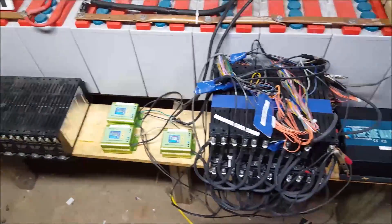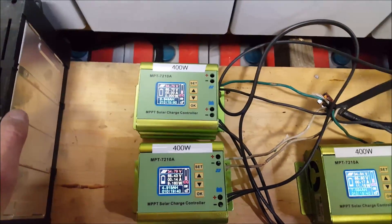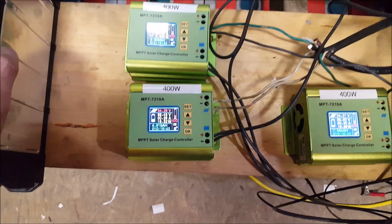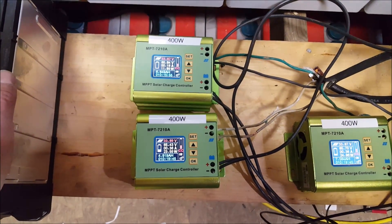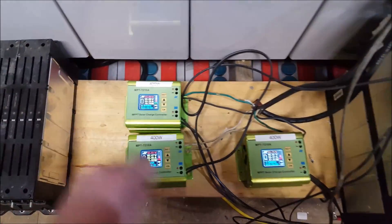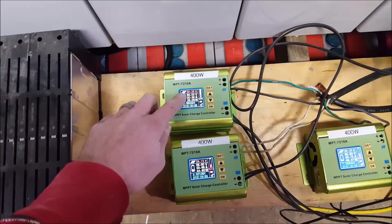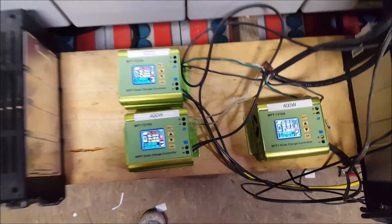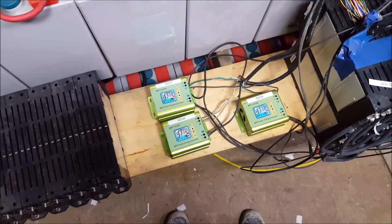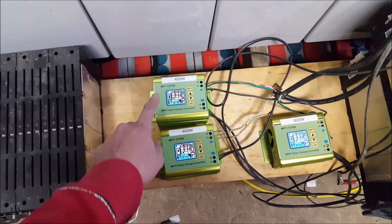Just wanted to put that out there. We're going to check power production — there's cloud cover and the sun's almost completely down, quite cloudy. These inverters are all sharing current. What's happening is if one takes too much power, I have the solar panel side on each of these spaced out half a volt in between so they share quite well. You can see this one has the lowest voltage because it keeps turning on and off before the rest.